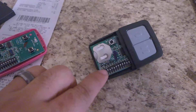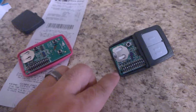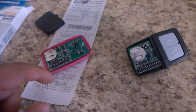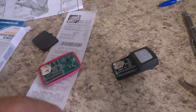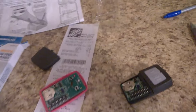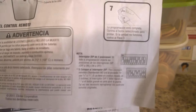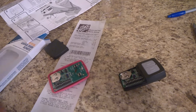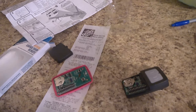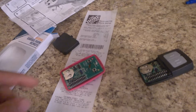What you do is take the DIP number from your garage door opener and copy it to the remote. In this particular case I copied it and it didn't work. On the bottom of the instructions it says to reverse them — so if it says one on the garage door opener then you put it at zero. If it's two, you just reverse the buttons, up-down or down-up, whatever. Then to program it — here's the key — it still has to actually learn the program.